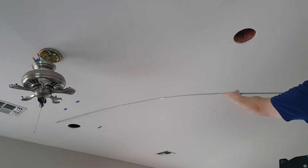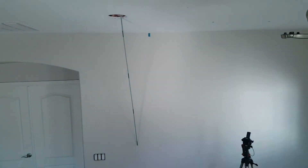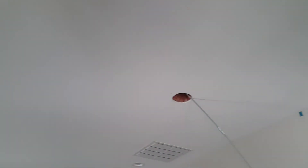To fish the wires, I have a combination of steel fish tape, which works great in open spaces, but a stiffer pole is better for working with insulation. I don't have a glow rod, so I tried — and successfully used — a camping tent pole. I measured out the length of the tent pole, then from the back end started to break it down, inserted a couple segments in, and as I pushed further I extended the segments all the way through. I just had to reach in with my arm and pull it down, then tape on the Romex and pull the pole back out.